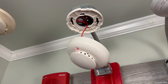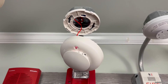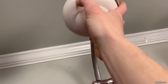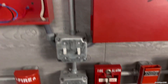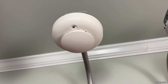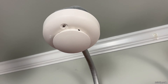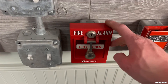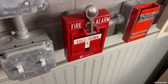It's strange — I used this detector on my other demo system, my first demo board, and it worked just fine. So maybe the zone output is a different voltage. Anyways, let's put this back on its base, reset the system, and do one final test where we will pull this last pull station on this system and reactivate the smoke detector. I think the way we will set off both systems is spraying smoke saber into the ESL smoke detector and then pulling this Simplex pull station. The model is 2099-97-96.